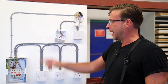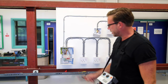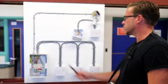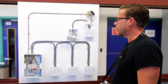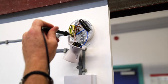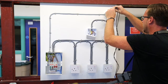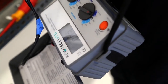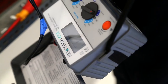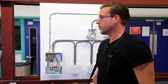While the temporary link is connected between our line R1 and our CPC R2, it's also the position required when you carry out your pre-energized polarity checks. At the light we can test between line and CPC, and then simply open and close the circuit to make sure that the line is switching accordingly.